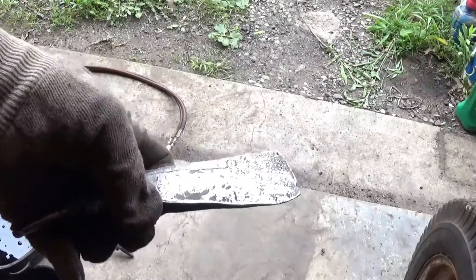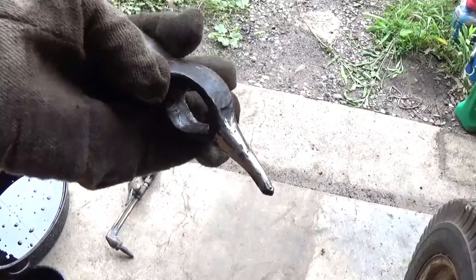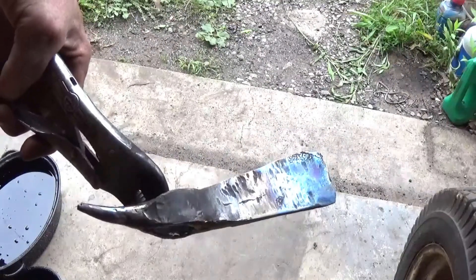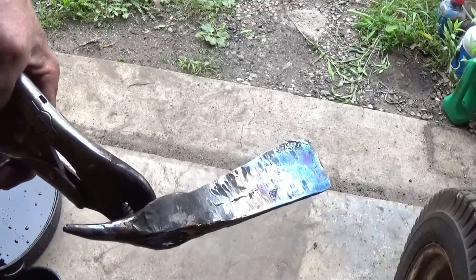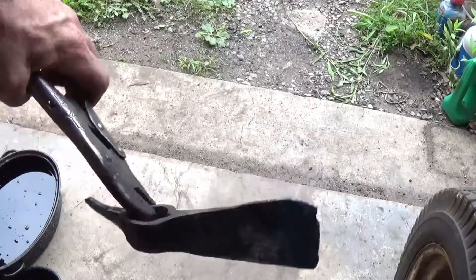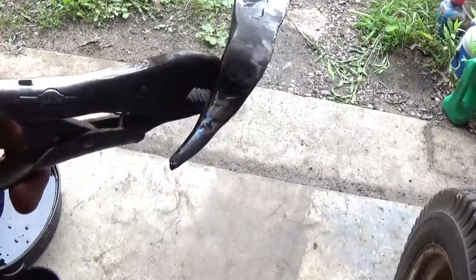I shined the metal up and put a sanding disc on it so I'll be able to see the color whenever it transitions. Same thing with the back. I'll heat this up and then show you once the color is obtained. This is after what I call drawing out the steel - you can see the blue discoloration in there, which means it got up to the right temperature. Some people will throw this in an oven and let it sit for an hour or two at 400 degrees - I'm just going to let this air cool.